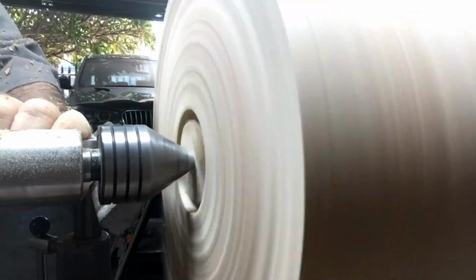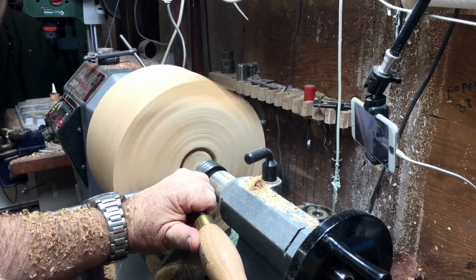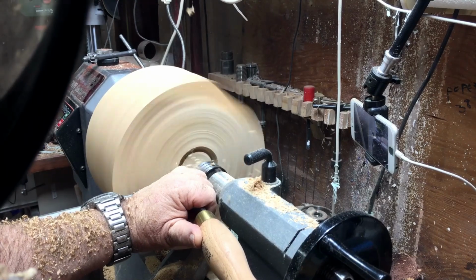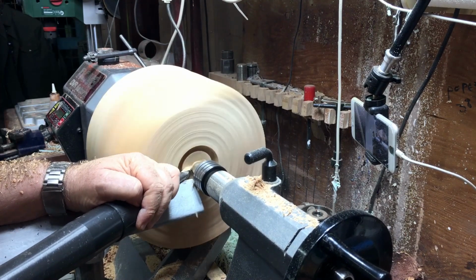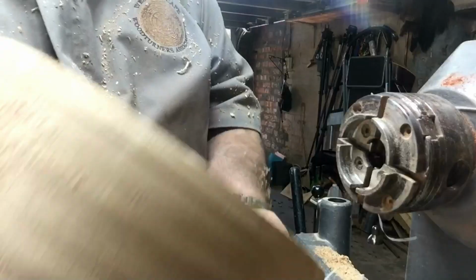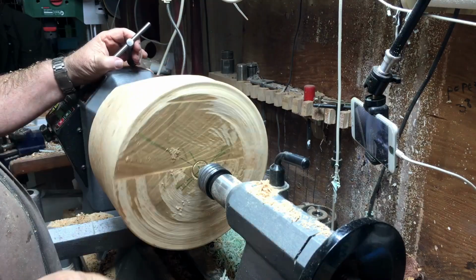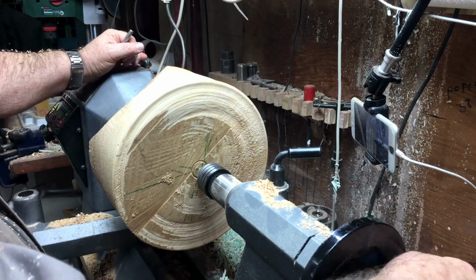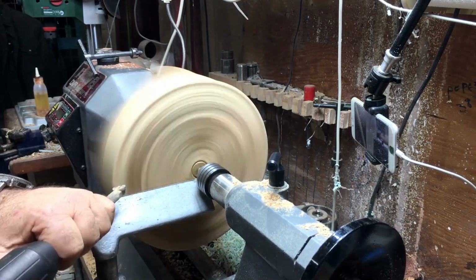Like I said, I'm using a piece of cypress that I got. It's a beautiful piece of wood. In my opinion, it was very dry wood, but you'll see later. Here in the middle, because I know that cypress sometimes is also soft and it breaks easy, I made a tenon and I made a recess at the same time. So if something goes wrong with the tenon, I can use the recess to continue with the project. And behold, that's exactly what happened. You will see just now.